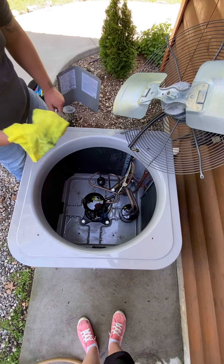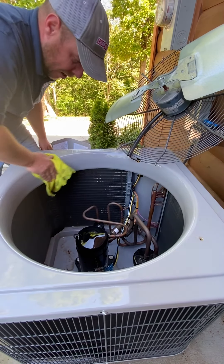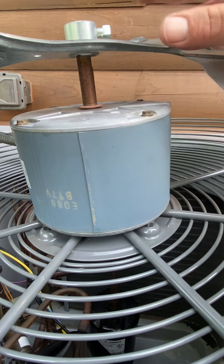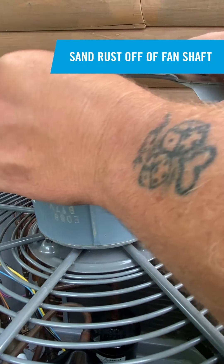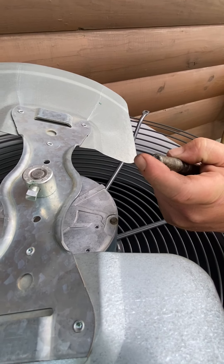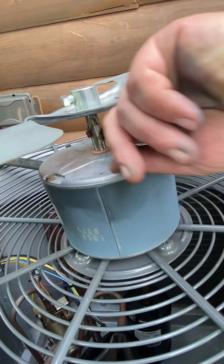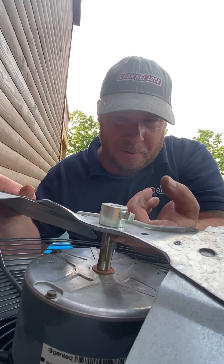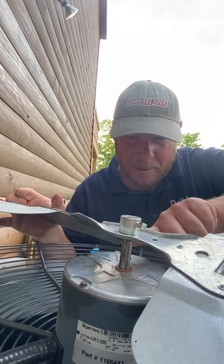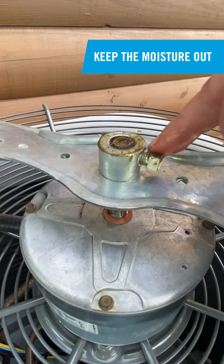Now that the compressor is semi-dry, take a microfiber cloth and wipe the inside of the fan section down, because you won't have access after you put the fan back on. Looking at the fan, you'll notice the shaft is starting to rust a little — that means the original grease coating protectant is gone. If you can get some sandpaper on it, sand that rust off. If you have access to grease, put a little on your finger and rub it on the shaft all the way around — that restores the protective coating from the factory and prevents moisture from getting to the shaft and hub assembly. Put a little grease on the hub section and on the set screw as well to keep moisture and rain out. This little step can save you from having to buy a fan blade in the future.